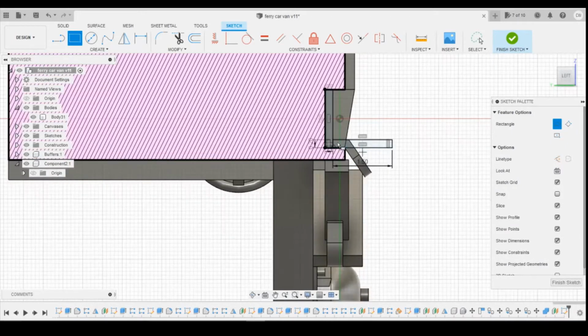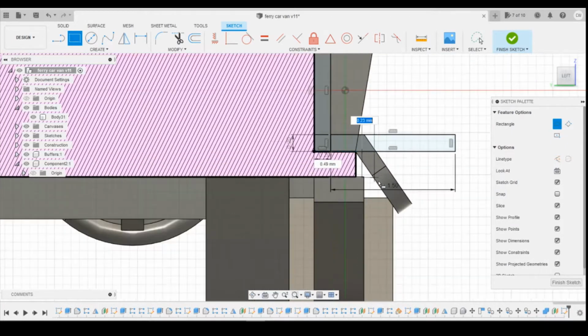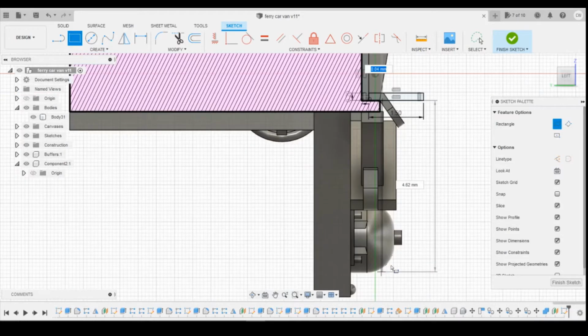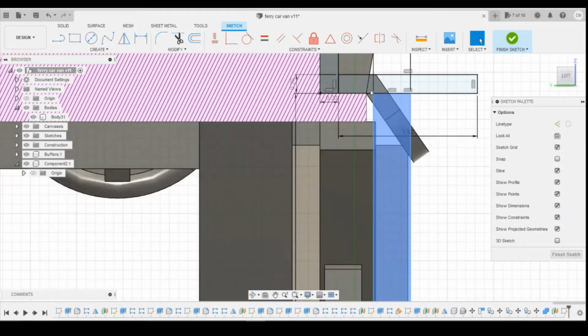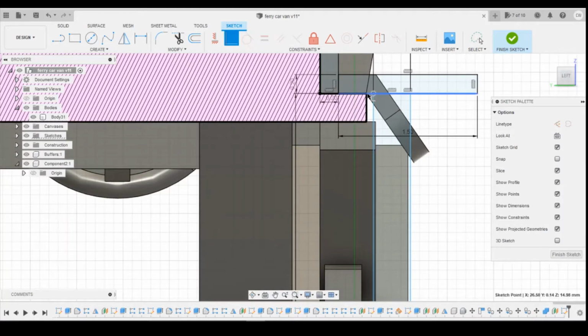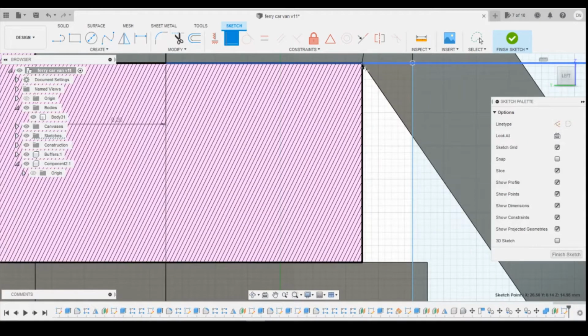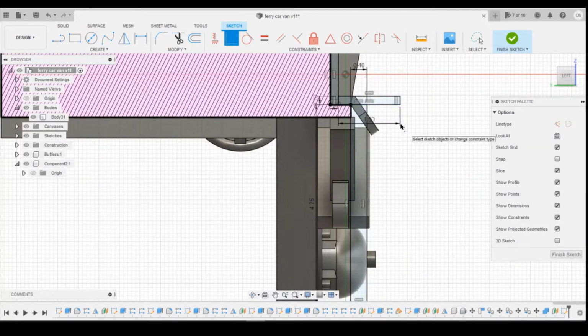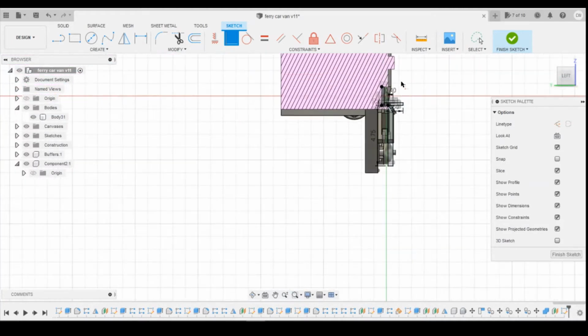And then we need to come vertically down. So we're going to snap another rectangle in. I'm going to come down. If we look at the height now, the bottom of this bracket is probably level with the bottom of the actual box. Okay, so we're going to go for 4.75 in height. I'm actually going to go a little bit thicker on this, 0.4 just with a bit of strength. And I'm going to constrain this corner into the corner here. Snap, okay, so that's the vertical. The step's going to sit on here. Maybe needs to come out a little bit, but we'll see in a minute.